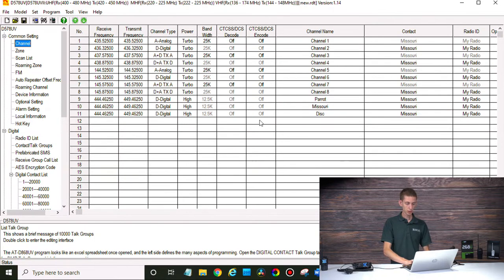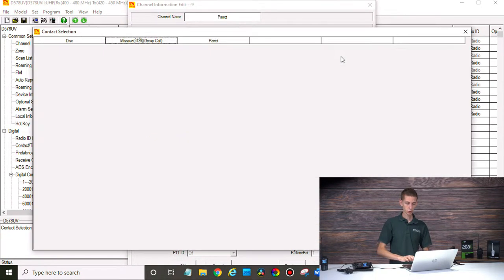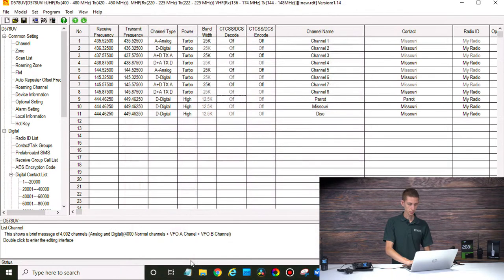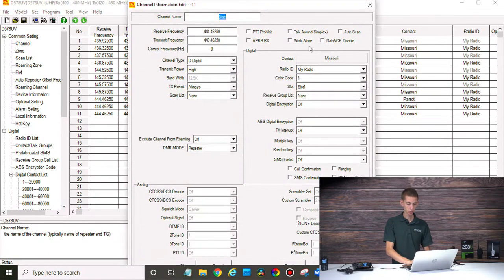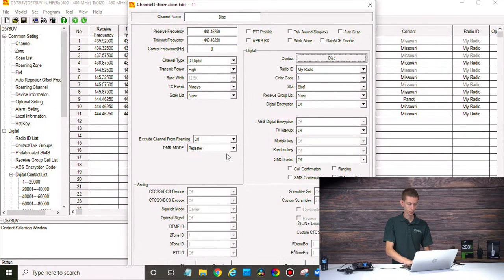So we've got our channels. Now, we want to come back over here and make these a different talk group. So, go ahead and double click on one. Now this one is, we know it's the parrot, so we're going to change it to be the parrot. So just click on that contact and then double click on that parrot and then say OK. Perfect. We're going to do the same thing for, actually Missouri's correct. We're going to do the same thing for the disconnect. We'll just change this over to the other talk group we created. Just like that. Perfect. We're in good shape here.